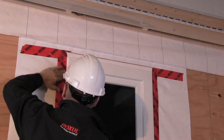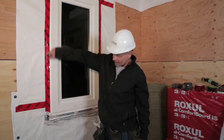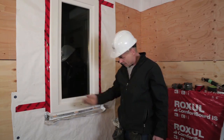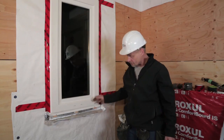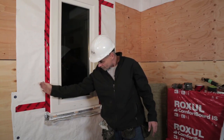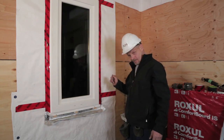I've finished the window and its install. I've installed the redundant or secondary deflective element for moisture and taken it around the three sides. My sill is open for drainage. I've used sealant to connect for air barrier continuity — membrane, sealant rod and caulk back to membrane.